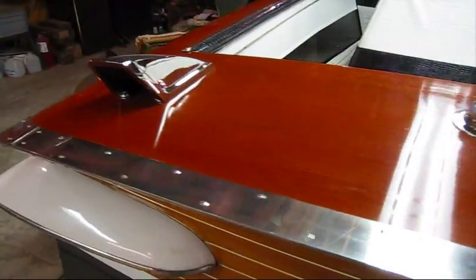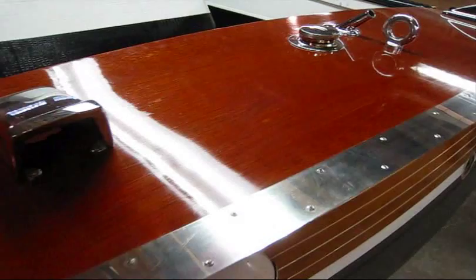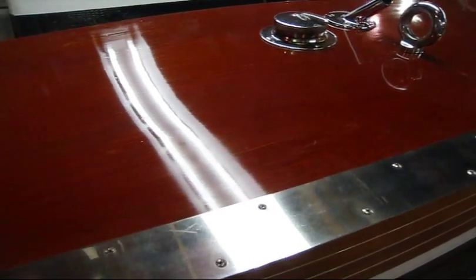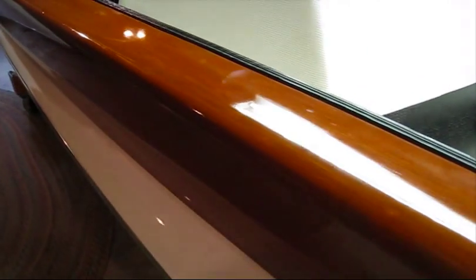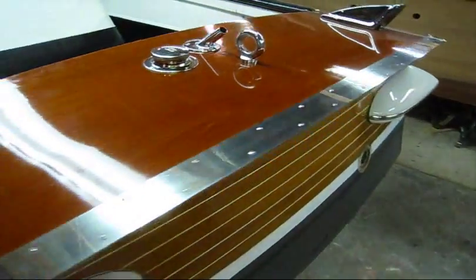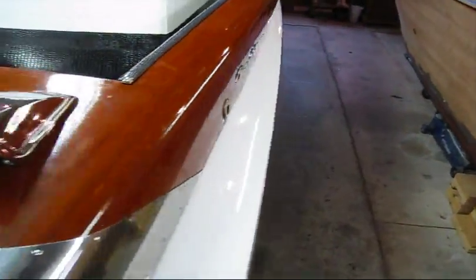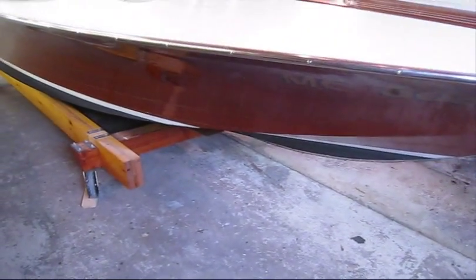You need to be on the offense because the top couple of layers of varnish are really sacrificial. The sun is going to start to eat away at the top couple of layers depending on how much exposure it gets. This is a perfect time to varnish — when it starts to get a little bit dull and it's a couple of years old, depending on whether it's in a boathouse or not. That's the best place for a wood boat like this. I've worked at a boat yard where big boats with a lot of brightwork are out in the sun three or four months every day, not under cover, and when they come in every year it's the same process — take all the hardware off, sand it down, and apply more varnish.